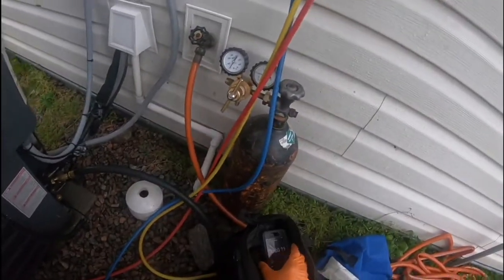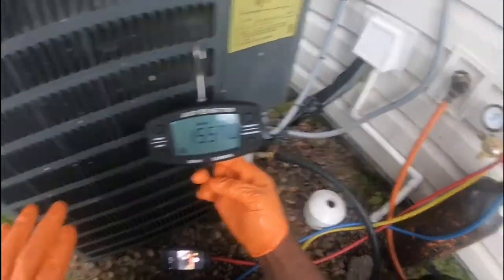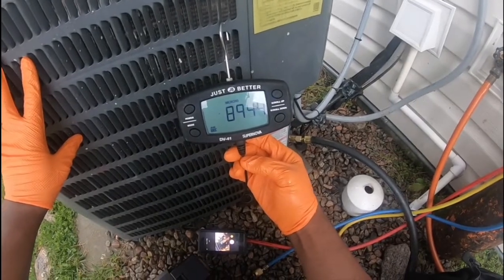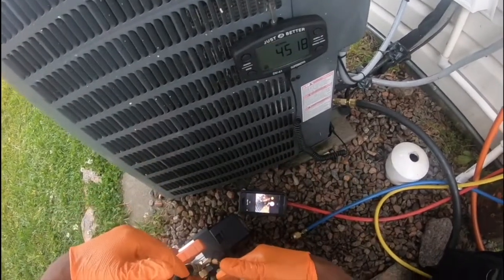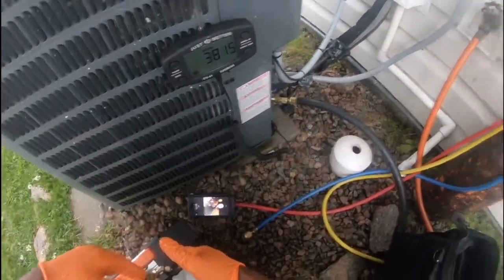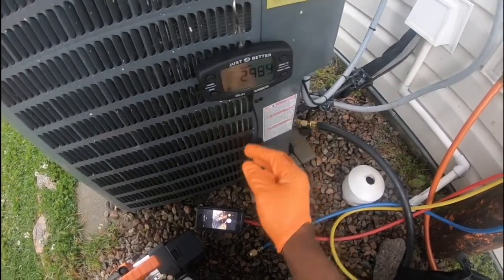As you can see it's already pulling down — look how fast. To be granted, I have the unit pumped down right now, so all the refrigerant is inside the condenser and I'm just pulling from the evaporator. I also removed the core from the suction line. So far with the JB evacuation kit, these hoses, and the NAVAC 4CFM, it's been 57 seconds and we're down to 3200 microns. It's coming down fast — I don't expect it to take very long.